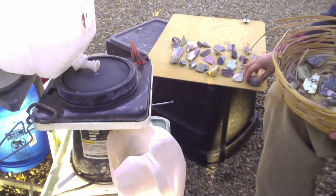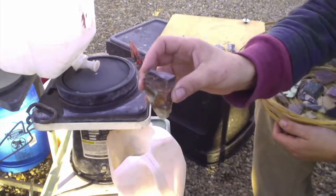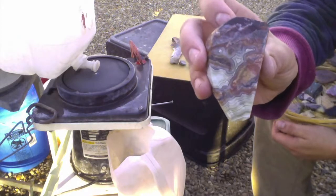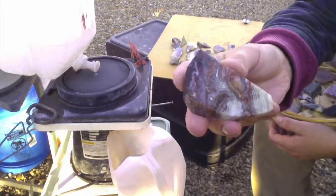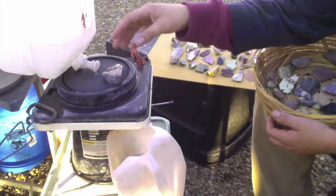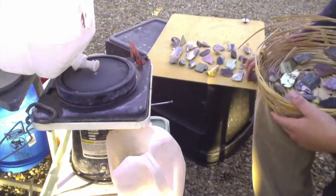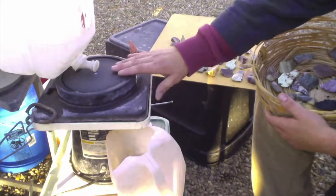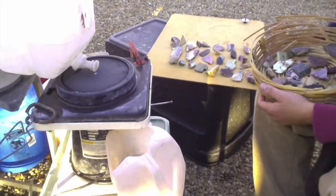Some stones were hardly even fazed by the silicon carbide. The silicon carbide wheel was practically burnishing the scratches left from the diamond flat wheel on this piece of agate. It just was not going to work. If I had all day, perhaps something to hold it on there and come back in an hour or so, yeah, it would work, but it's just not working out. It's got to get hit on the grinder. I've actually seen Covington machines that clamp the flat lap.